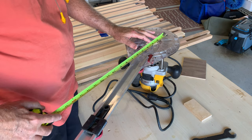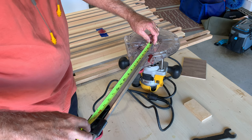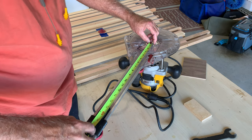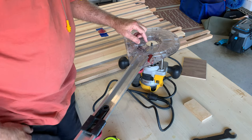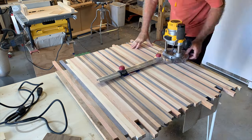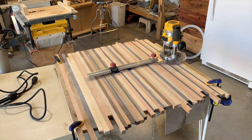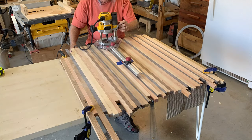To set our radius, we're going to measure from the edge of the drill bit — not the center — from the edge to the center of our point. We want that to be 15 inches. So our radius is 15, which makes our diameter 30 — that'll give us a cut around the circle. I put my router on my circle-cutting jig and do a trial spin around the block to see if it has the right cut, then I get ready to plug it in and crank it up.